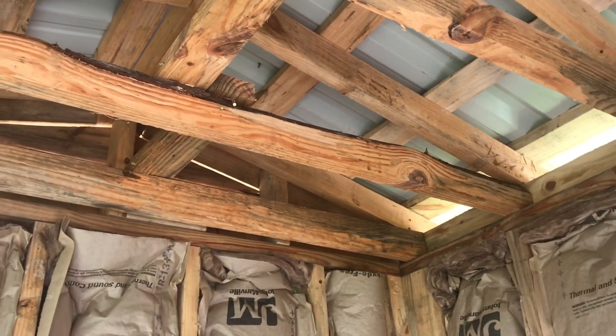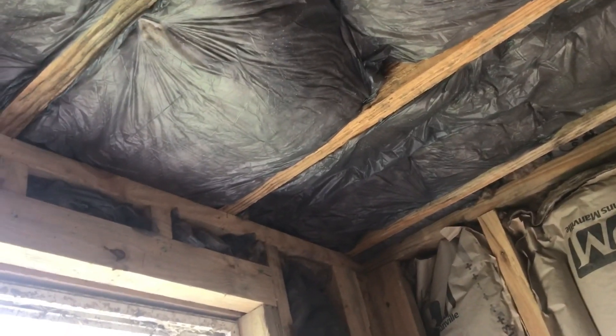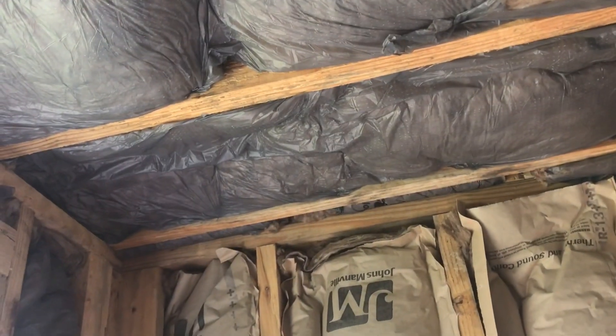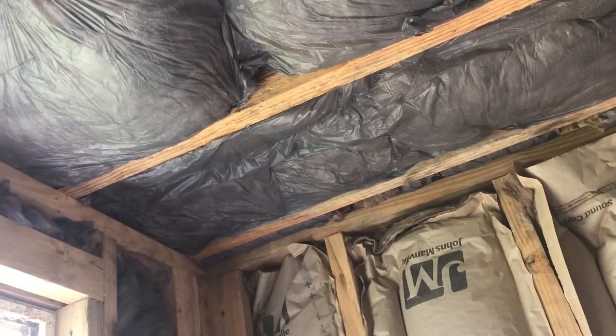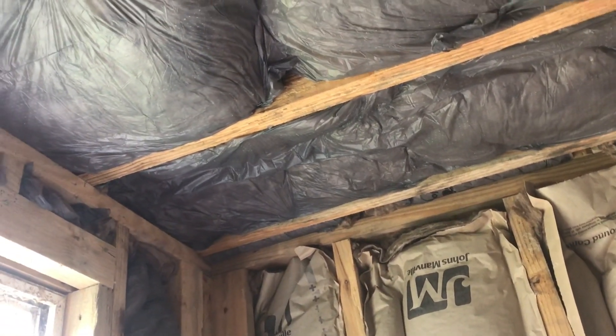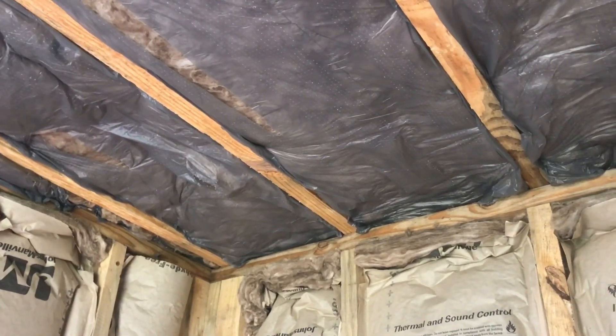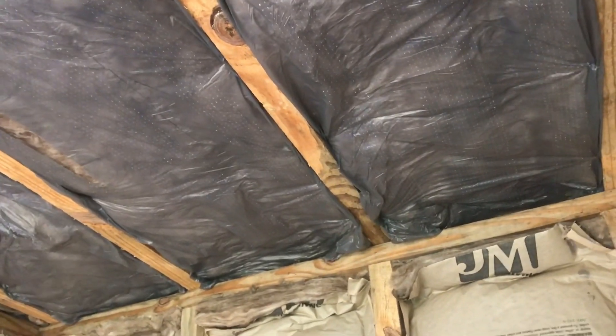I'm trying to get this done before the weekend - it's supposed to get down to about 20 degrees, so it'd be really nice to have it all closed up. Insulation is up in the joists and I got the rest of the wall insulated. I switched over to this plastic-wrapped insulation - probably not the right stuff for the job. All I've ever used is kraft-faced, which is great because it's easy to staple. This stuff has no way to staple it in, which means you'd have to run some sort of mesh or chicken wire, or lay it up in an attic once the ceiling is in place. I bought it because it was a little cheaper than the kraft-faced - I figured I'd try it.